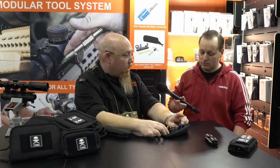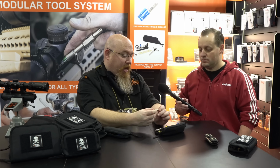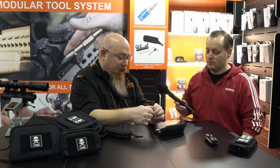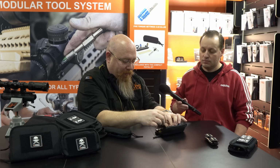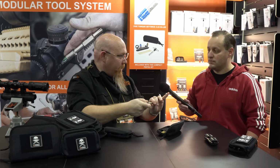1911 bushing wrench, Glock front sight tool, our mini all-in-one torque limiter, both punches that can be used for multiple different guns, whether the striker fire pistols or anything like that to drift, dental pick, aim point sight adjuster. We also utilize a 8/32 threaded adapter. So being that all gun cleaning products utilize the 8/32 thread, we have a male-female and a female-female for adapting, so you can run anybody else's product with that and adapt it to ours. The small cleaning brush, for optics, for adjusting on windage and elevation, and an assortment of bits, brass cleaning rods, and the same takedown ratcheting torque T-handle.